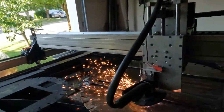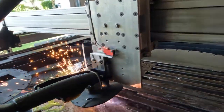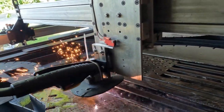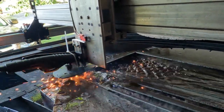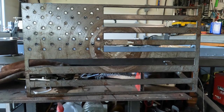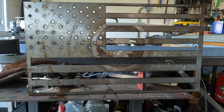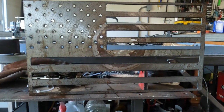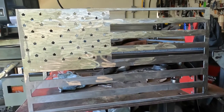The power density is pretty impressive when you think about it — this is all off a 220-volt single-phase plug. My speed was a little slow; I should have been more like 80 to 85 inches per minute. I think I had it at 70 or 75, with 35 inches per minute for the small detail parts — the stars — and 70 for all the long runs.